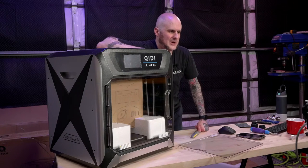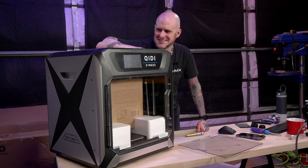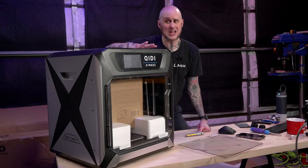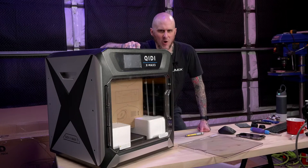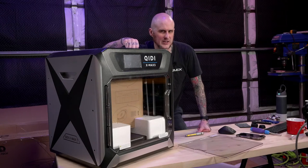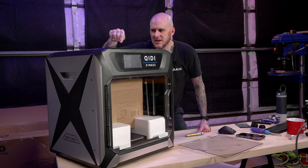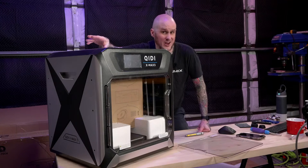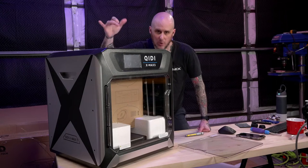We have a lot of money, don't know anything about technology market. Sure, I guess, but the technology here is... I really think you're getting a lot out of this machine for what the money is. Like, what other Core XY 325 by 325 build volume machine is on the market at all, let alone at $1,000? It's also got an active chamber heater, which nothing in this price category does. There is a PTC heater inside of here to create an actively heated chamber for higher temperature printing.